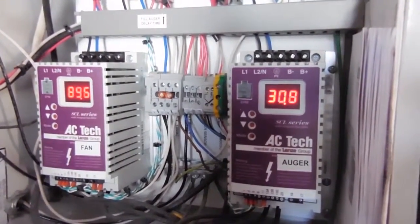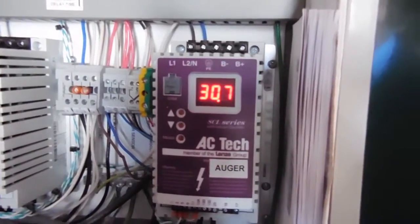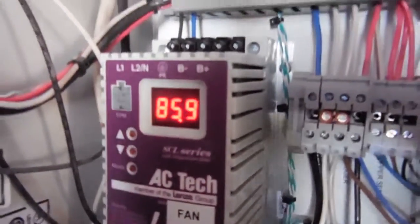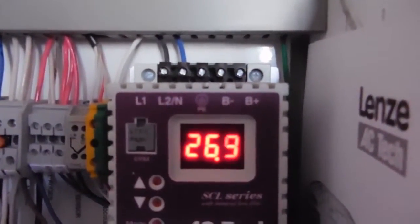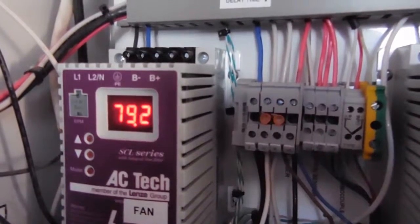At about half speed, the fan starts coming back. Now our fan is slowing down, and that will continue to slow down in proportion to temperature rise. As your water temperature climbs, your fuel rate — your firing rate — drops to try to compensate for the reduced heat load.